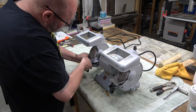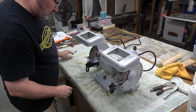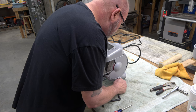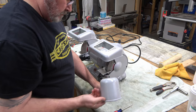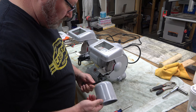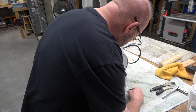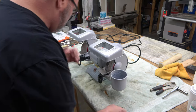We'll do the exact same thing for the right side. Next, we've got a capture screw to lock the quench cup in place. You've got the quench cup and the quench cup bracket. Some of these don't have that screw on the side, but this one does. On my other grinder there's no screw on either side, which is no big deal — it's not like the quench cup is going anywhere.